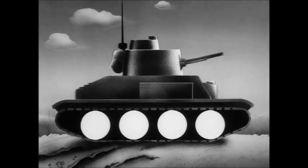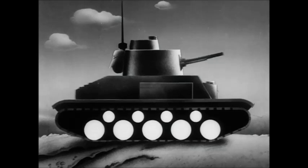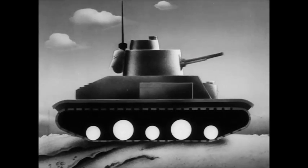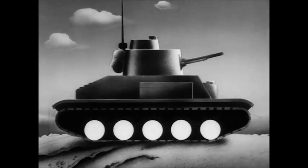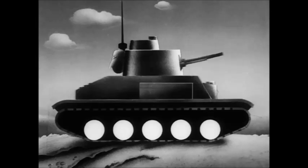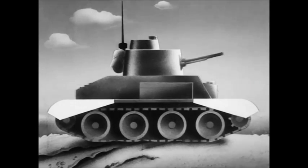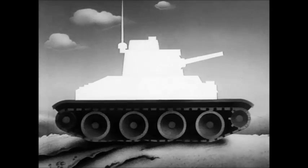Back to the bogies, they may shrink in size, in which case our tank may have jockey wheels to carry the track. Small bogies may be independent, linked in pairs, or of unequal size. The suspension, upright, oblique, scissor, and a pair or more coupled by girders, which is not altogether unknown. And don't forget, in some cases, bogies may be partly screened from view by dust guards or mud guards, which are fitted under active service conditions. Or by skirts, sometimes with mud chutes to get rid of the muck. Detail of turret, hull, suspension.